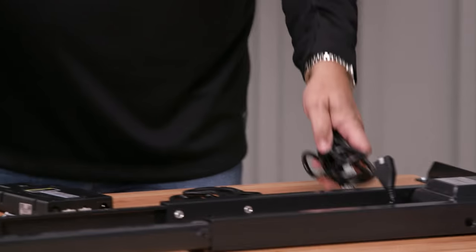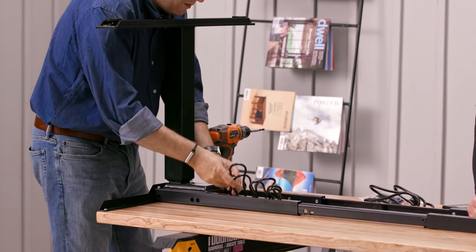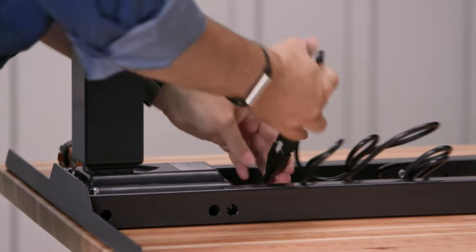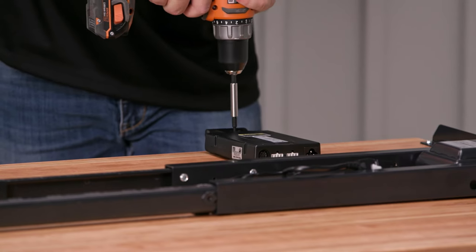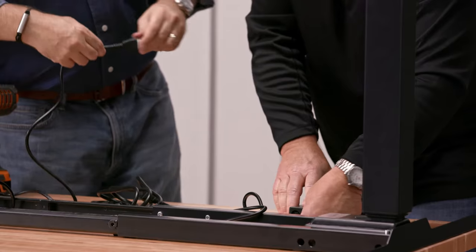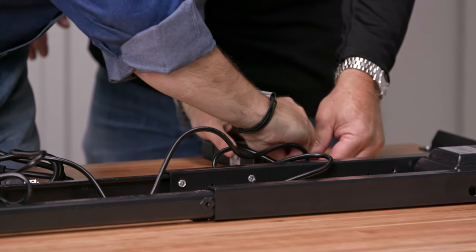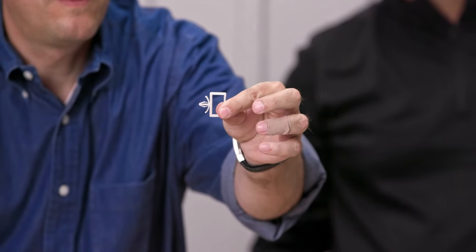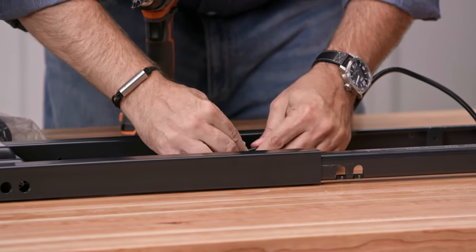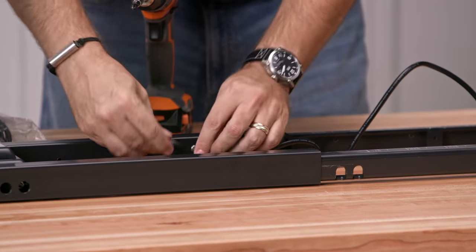Now we've got our three cords. Basically what we're doing, we're powering up both of the legs. The industrial engineers like the quick-connect. You just pop it in and go until it clicks. All of our lifts will come with a control pack. Then take the two connective cords and click those into the drive unit. On the interior part of this rail there are little holes — these little quick clips, or wire harnesses — they just pop in.